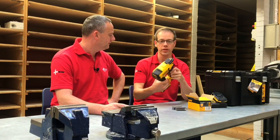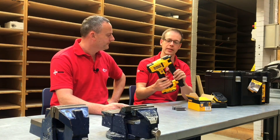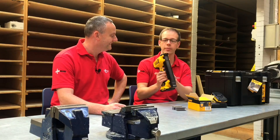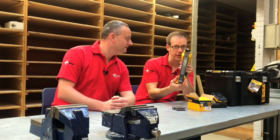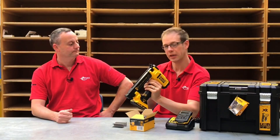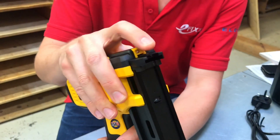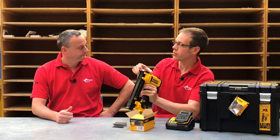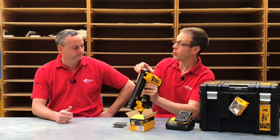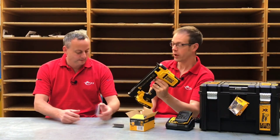Some more nice features — we're very interested in safety, obviously, with all people using this equipment safely. This isn't loaded at the moment, but there is a safety feature: a little retention switch, a small actuator, that means unless it is pressed down onto a cable, it simply won't fire a staple. So it's not going to happen just while you're carrying it around — you're not going to accidentally fire a staple into your leg.